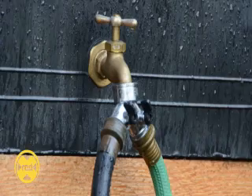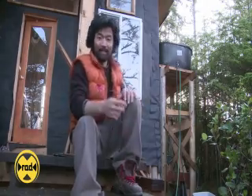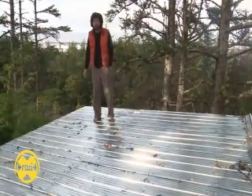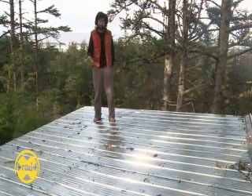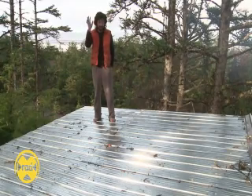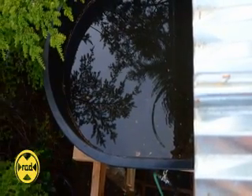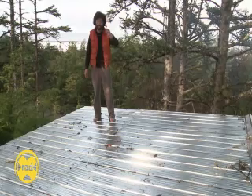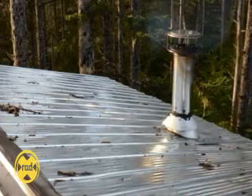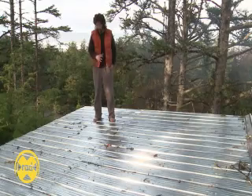The other garden hose is actually for my shower system, which is still not regularly operational yet. I'll take you up onto the roof so you can see the water tower from above. This is the side of the roof — it got sheeted in tin, so there's not much of a drop to it, but all the rain trickles off to the side, into the gutter, and then runs down into the water butt. I've got all this catchment area on this side of the roof. I purposely put the stove pipe on the other side so that all the creosote and ash and smoke that comes out of there doesn't fall onto the roof side that takes all the water.